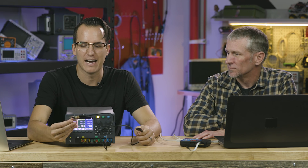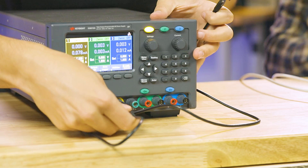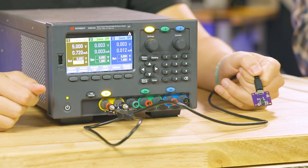So we're all soldered up. I will admit to bringing in some backup because my soldering skills are rough. Now we're going to check it with the power supply using a little adapter. Why would you use this instead of just plugging it in? This is a corporate laptop — I don't have much problem plugging in an untested USB device. But if this is my home computer, I wouldn't want to plug something I just built into the USB port in case I shorted it out. I'd much rather use a power supply designed to sense over-current conditions and shut things down before they get bad.